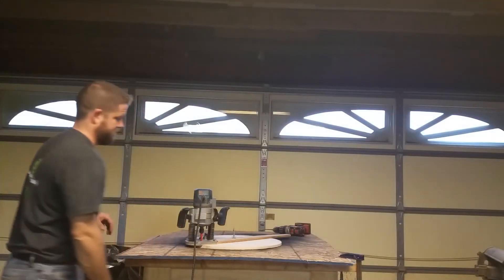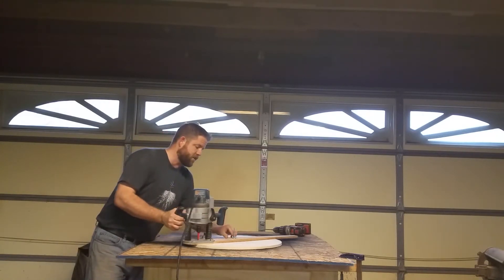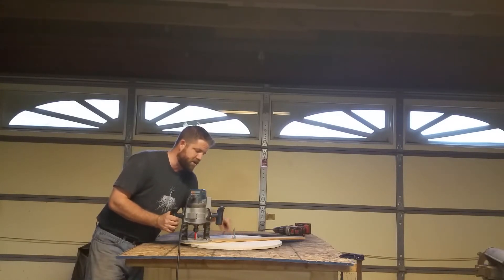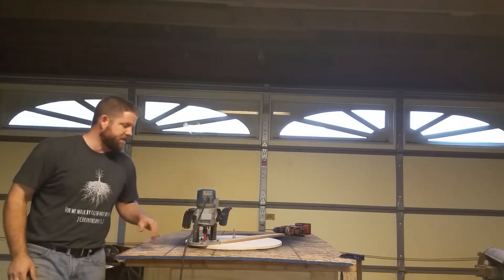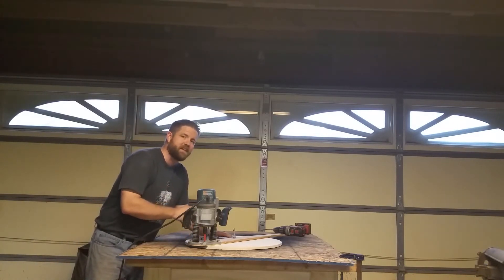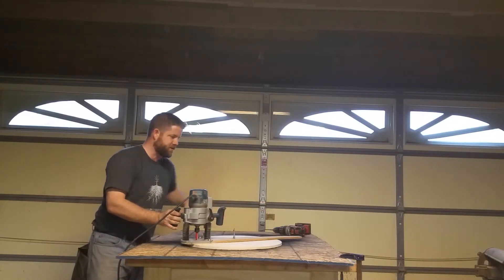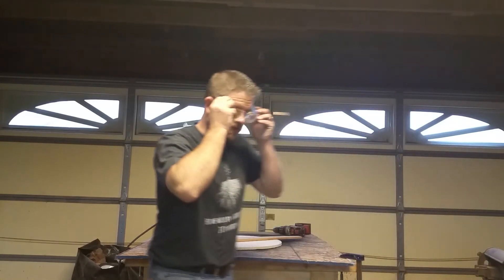I think we're ready to cut the inside circle for the ring of the UTA. I've got the central pivot point in — just a quarter-20 bolt — and then I just put a nut on top and cinch it down so that doesn't wiggle whenever I go. I'll put on my safety glasses before I start routing. I point out that the router is probably the most versatile tool in the shop, but it can also be the most dangerous. I like to make sure I'm going to be able to clear everything and there's nothing in my way whenever I'm walking around and routing, because if it gets hung up it will shoot back very, very quickly.